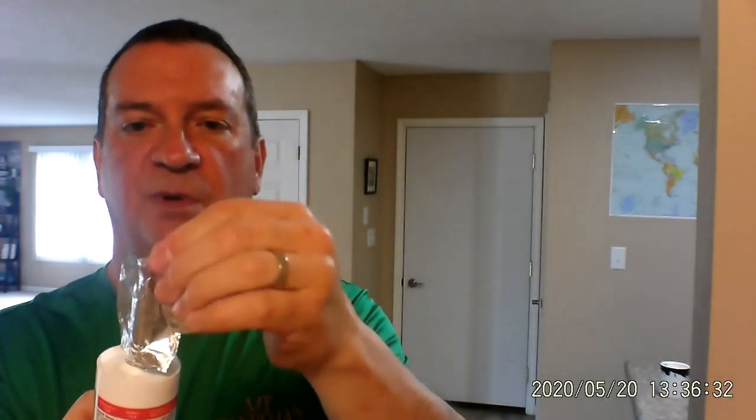This stuff doesn't let any air in — that's why I use the furnace tape instead of duct tape. This is going to last me now. I can wait maybe six months, a year. I can certainly use this again because I've got a nice solid seal on it. Not only do I have a small screw in there, but I also have it wrapped with furnace tape.